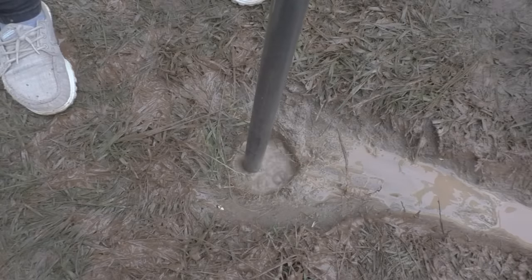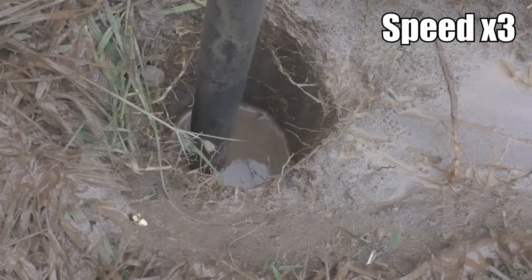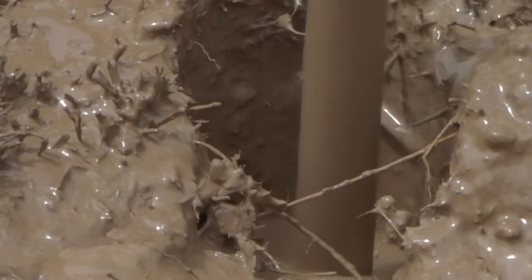Also, it is possible that the water sinks away into the ground. What actually happens is that we reach a layer which absorbs water very well, and the water can flow into the ground. So in this case the drilling fluid, or the mud, can coat the surface of the borehole to decrease the water loss.